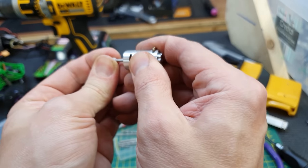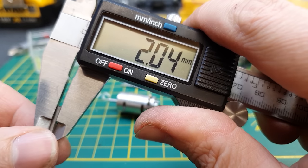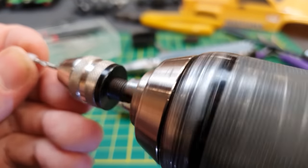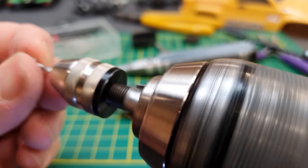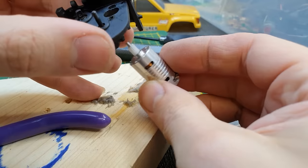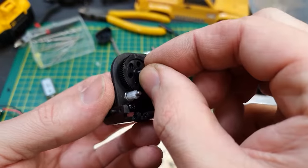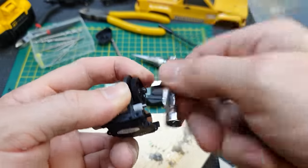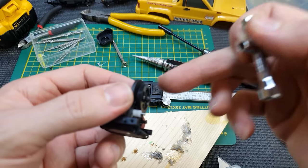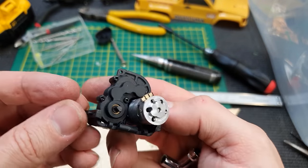With a bit of luck that's going to push onto there perfectly. It's still tight — my next size up drill bit is 2mm and that's going to be too big, so I think I'm going to have to use the existing drill bit and just give it a little bit of a wiggle. You want to be careful when you do this centre nut up — you don't really want to do it up tight at all. Just do it up enough so it just touches the spur gear. If you start cranking this down you're just going to force that spur gear into the gearbox and it's all going to jam up. Look at that — it's turning perfectly. The motor's mounted — this is going to work.